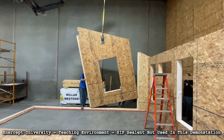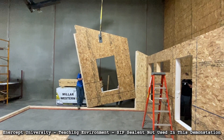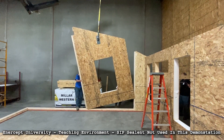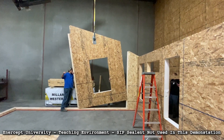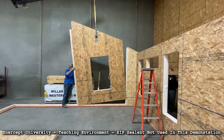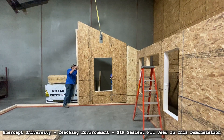It's also eliminated a thermal bridge by having the foam in between. Our headers look like this as well in most cases. Sometimes — with a garage door header, for instance — we can't put the foam in because we might need a triple LVL over the garage door. But everywhere we can, our headers look like this. We actually run our 2x4s through a shaper so that they go together more easily on site, and they do have a rounded edge.